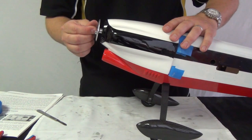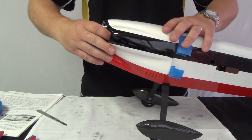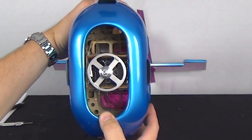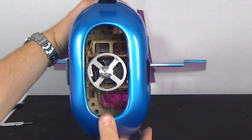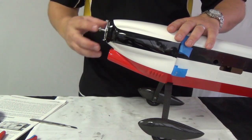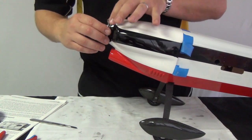For the proper alignment, you'll need the motor, collet, and backplate in place. For models like the Addictions, you must center the motor shaft horizontally and vertically in the cowl's large opening. It's a bit easier on the other PA models, as you can line up the cowling by hand using the cowl's curved lip to match up the backplate.